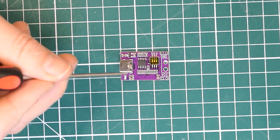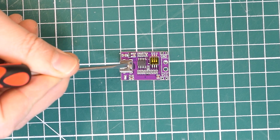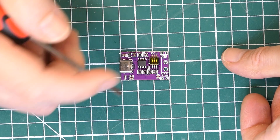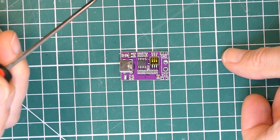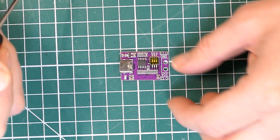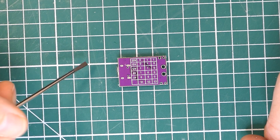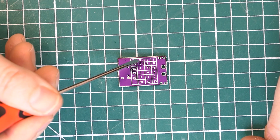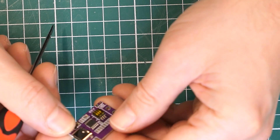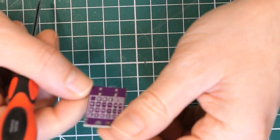This component is basically a voltage controller - it takes a USB-C input and by setting those little dip switches you can set the output voltage. For this example we want five volts. The guide shows how to set it: five volts means all three switches are switched off. If you wanted 20 volts it would be zero-one-one. These are five-volt strips so we're setting it for five volts - they're currently all set to one so that gives an undisclosed output.